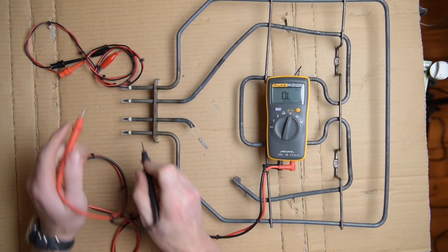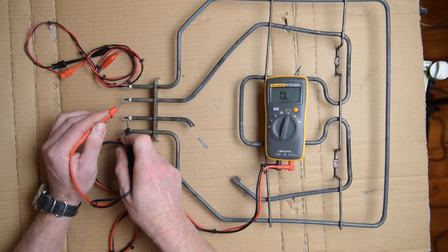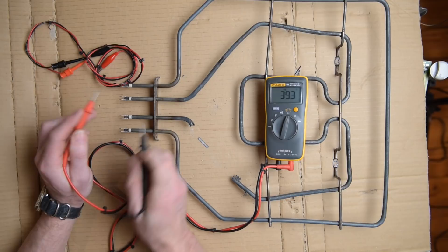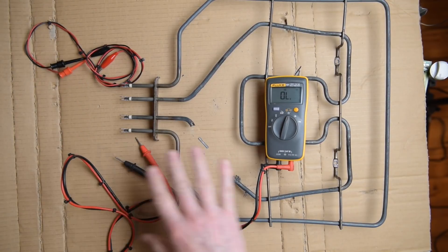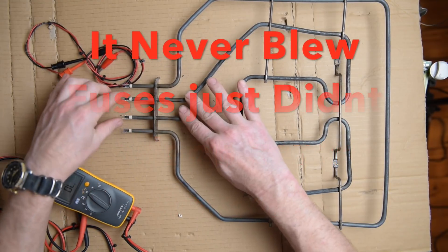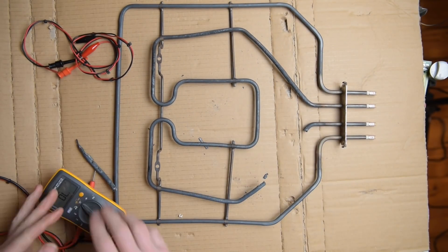In conclusion, you do two different tests: you do your resistance and get a reading, then check the other one. On a hot water cylinder you would check the top element and then check the bottom element — if they correlated to be somewhere close, you'd put it onto buzzer continuity, check that, and if it was through, no problem. If it was open line you would assume that second element was faulty. In this case when I initially tested this it showed open line on this circuit, so I was happy to change it. When I took it out I noticed the cut — I couldn't see it before. That's how I test things, thanks for watching.